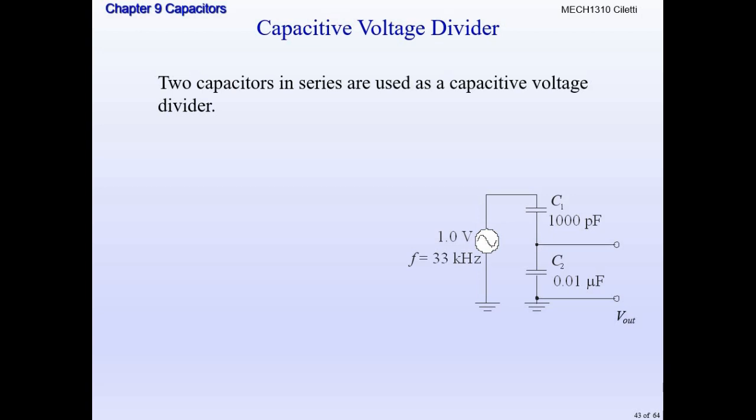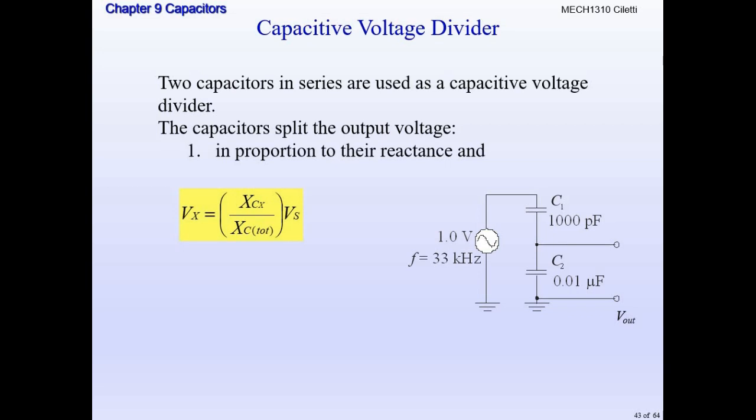All right, so let's work through this. We've got an AC source, 1 volt, 33 kilohertz, and we have a 1,000 picofarad capacitor and a 0.01 microfarad capacitor. If we want to use a voltage divider using the reactances, it would be that specific capacitor reactance over the total capacitive reactance. I would tend to do it this way with the reactances